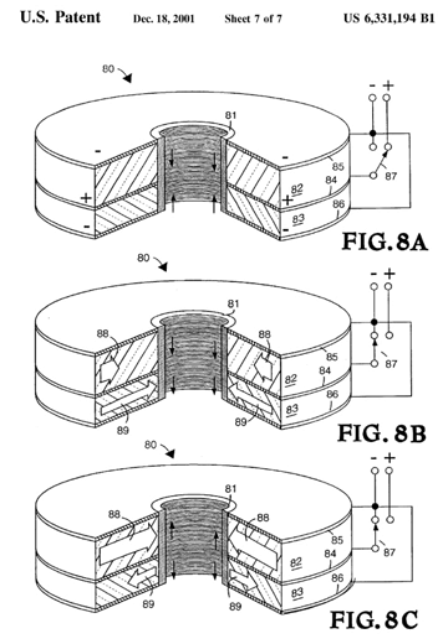The system is a spin-off of a DOE device to inspect nuclear weapons. This system requires several new advances because of the high energies, such as high-gradient insulators and a wide-band gap photoconductive switch—about 4,000 of which are needed.